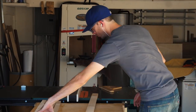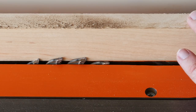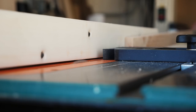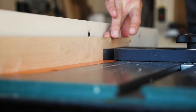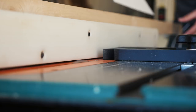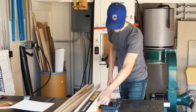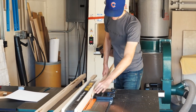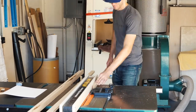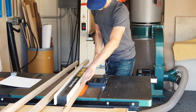Once you have all of your pieces, lower the blade of your table saw so that it's just slightly protruding into the workpiece — I set mine for right around an eighth of an inch above the surface of the table saw. Then you can cut a groove down the length of the piece. Check to see if your mat board pieces will fit into the groove, and if they do, you're good to proceed. Repeat this same process for all of the edges on your pieces. Technically you don't need a groove on the bottom of the bottom piece or the top of the top piece, but I wanted options when installing on the wall, so I just did both sides of every piece.